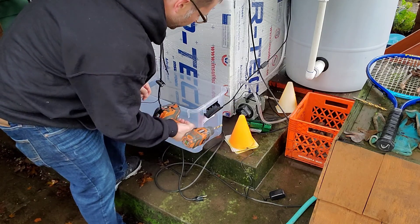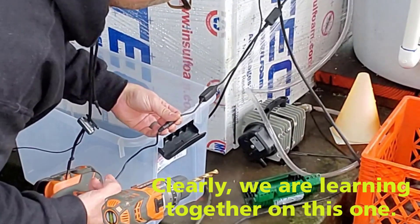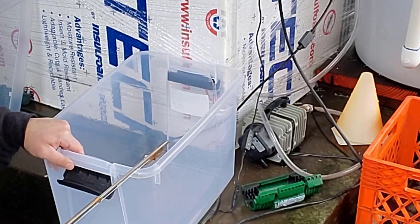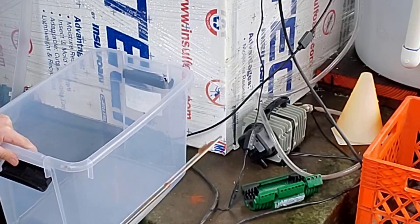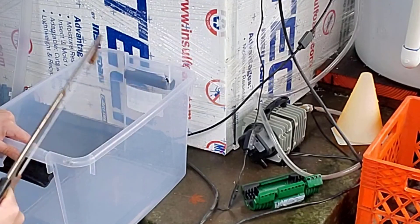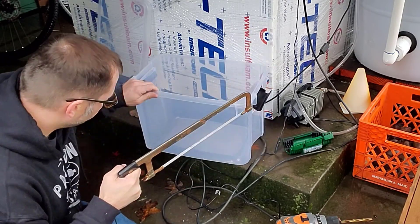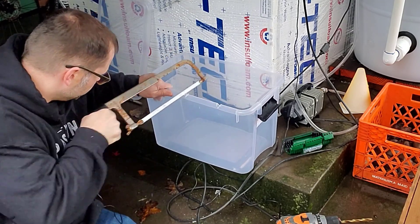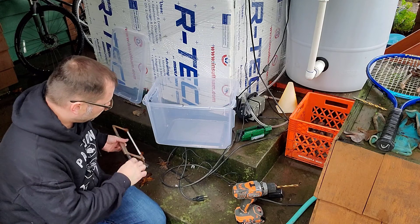This drill size is going to be used for the other electrical components too. Actually, that's not going to work either, so I'm going to go ahead and cut notches instead of holes. I think it's going to work better since some of these pieces have to fit through there and I can't get them in otherwise. Plus it's just going to be easier, and the lip of the lid is really what's going to prevent water from coming in. Good — a couple of notches in there, shouldn't be a problem to put those wires in now.